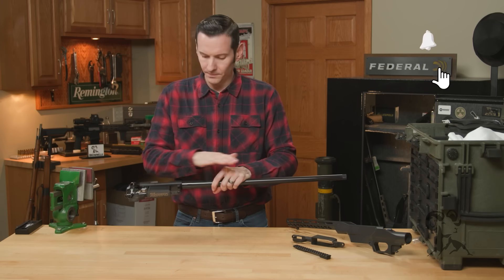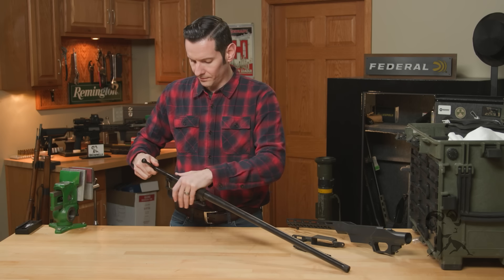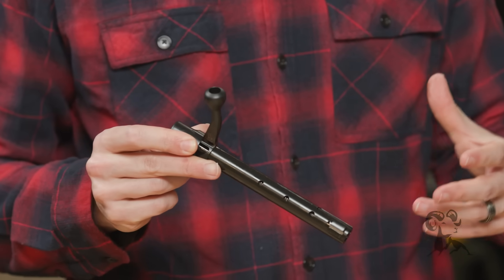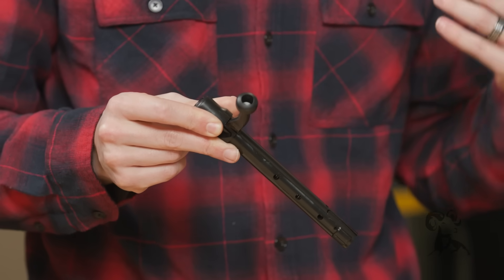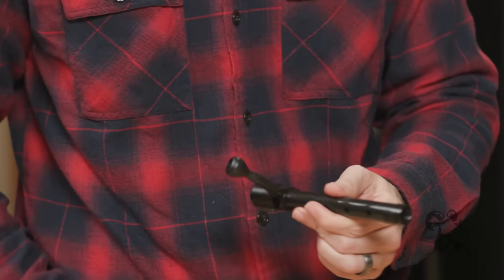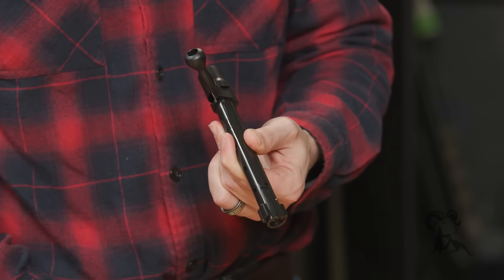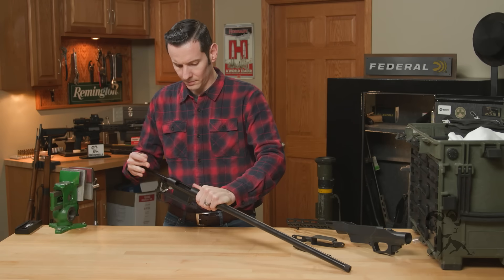So let's talk about the actual action itself, starting with the bolt. The bolts — they did a really good job with the machining. I don't want to compare this to the old factory Remington 700s, honestly, because these are just machined better. The bolt has a ton of lug engagement, which is something you've always been kind of missing with a lot of mass production factory guns. They have an M16-style extractor on there, which is arguably one of the most durable extractors for a bolt gun. You've got your standard style ejector, so it's a push feed type setup.